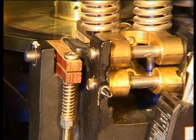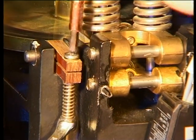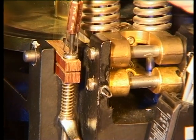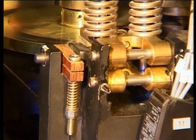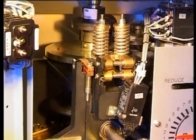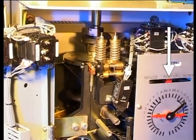Excessive swinging is prevented by clamping the brake harder. When adjusting the brake, take care not to over-tighten it. If you do, the drive mechanism only works in one direction. Check that the position indicator goes to the middle position after completion of an operation.